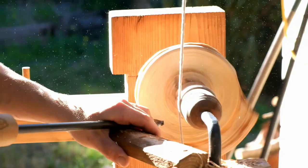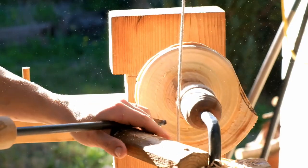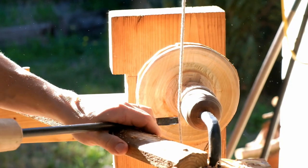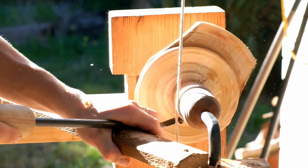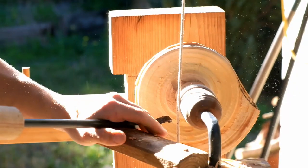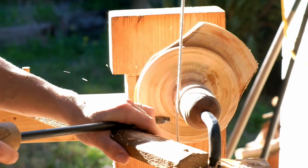We're about to see one and you'll see that my tool rest is going to jump up as the hook catches on the return stroke — there we go — and this continued to happen as I was turning the inside. Now I believe if you put the practice in to using one of these double-edged tools that problem would kind of go away, and it is really efficient having both functions in the one tool.